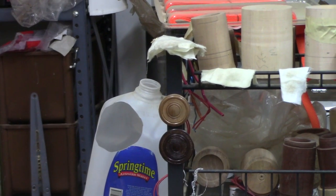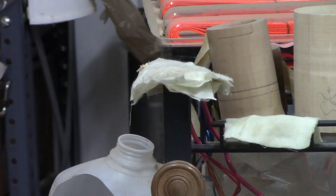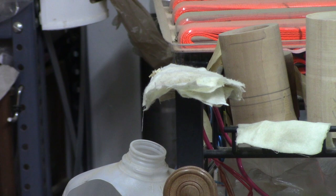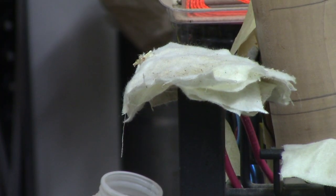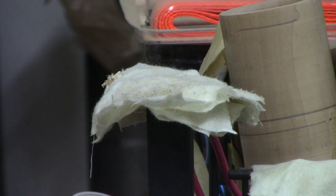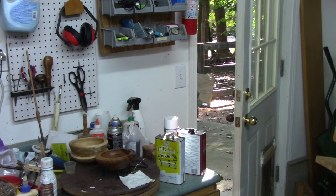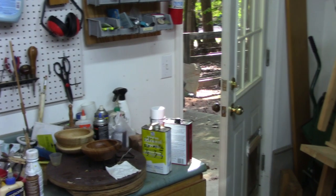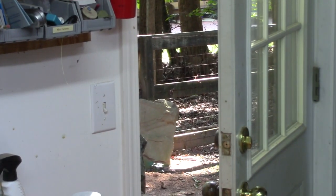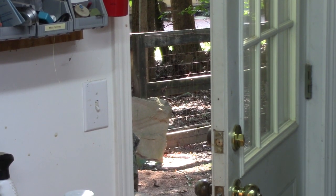Because of the risk of spontaneous combustion — which is a serious risk in a shop — when I finish with these rags, I just stack them up on the corner of this metal rack until they're completely dry, which might take two or three days, then I toss them in the garbage. None of this finish is something you want to breathe, so either use a respirator ideally, or if you use it indoors, make sure you have added ventilation. That's why I have my finishing area right close to the door — even in wintertime I can open it up for a little fresh air.